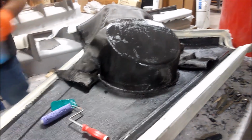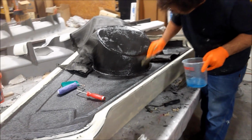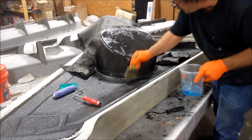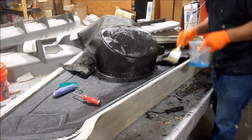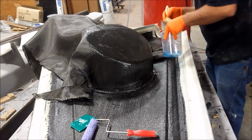At the same time, it's keeping it lightweight, because that core that we're using there is only 1/4 inch thick foam core, so that doesn't weigh very much. And this particular skin doesn't have any hard points in it. There's nothing necessary at this stage for that, so it'll come out fairly lightweight, which is kind of what you want with the wings. Some of the other parts of the aircraft are a little bit overweight right now because it's a prototype, but there's room for improvement going forward.